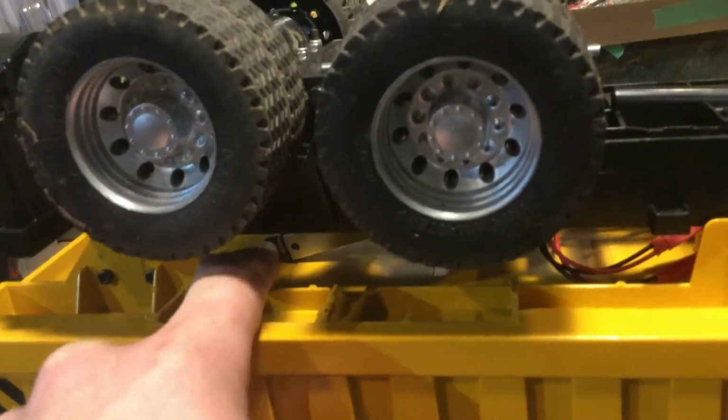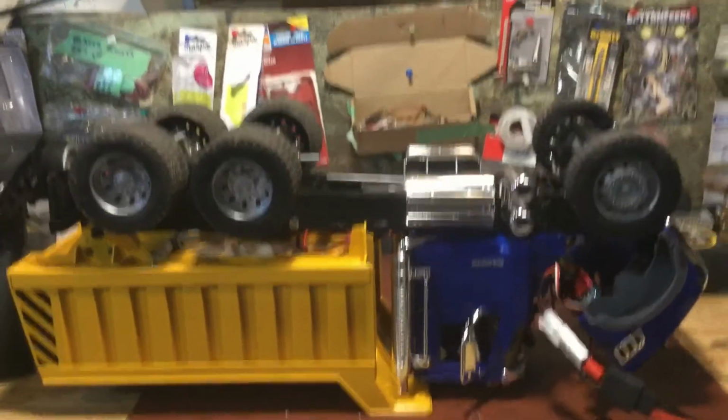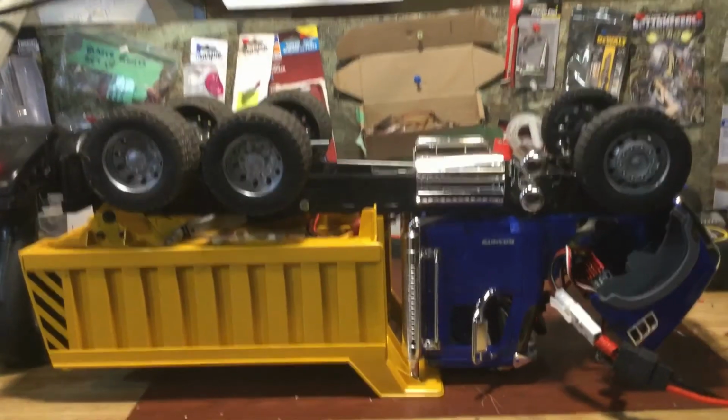And just for everybody wondering, I got an L16 actuator in the back there. This one's the 50 mil stroke one, which dumps fine. I might just go ahead and try and print some better little spacers in there than the 3/8 PEX tubing I have, just to help stabilize that a little better. But apart from that, yeah, super happy with it, and I'll see if I can do a little test video of it outside.